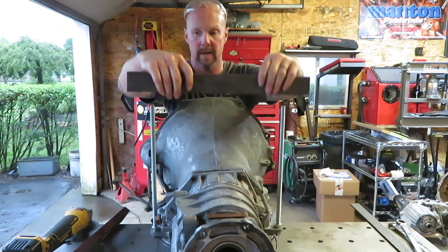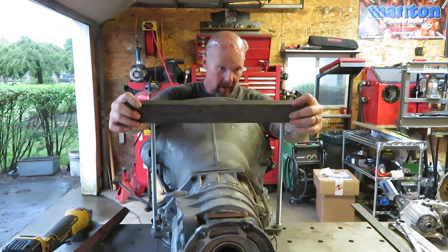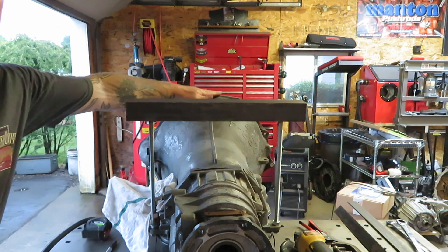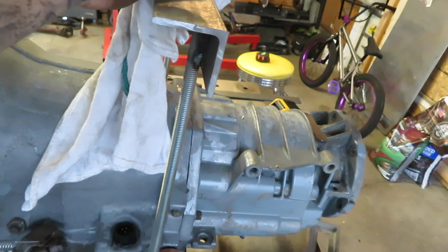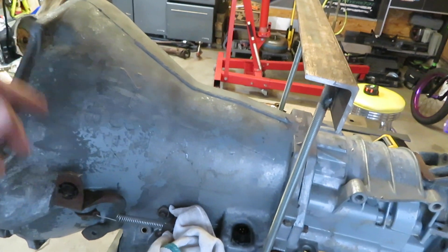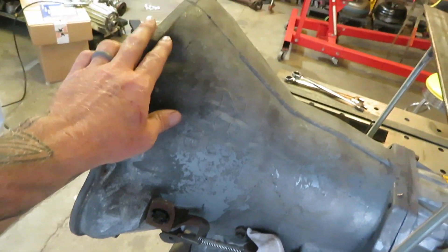With both of those bolted on there, I'm going to drop it in place, measure in from whichever edge I want, and weld that on there — that's how I think I want to do it. With that all welded in place — still a little warm — I think I'm going to go ahead and put this piece across the top here. There's just a lot of movement, more than I like. You can see how that's flexing back and forth, so I'll put this cross piece on and then those additional cross pieces across the top, which should give it a lot more rigidity with everything bolted together on the two bosses and the two bell housing bolts.